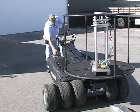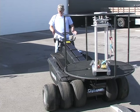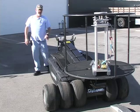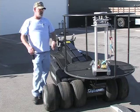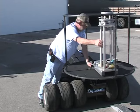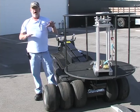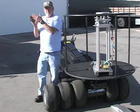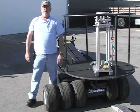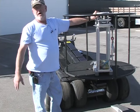Then your pump's off. When you're in a trailer, you want to make sure your drive system is off so that if something were to impact this, it couldn't try to drive itself out of there. Also, on this turret here, if you have the trailer loaded straight on, I want the turret straight forward and locked. That keeps, when you're driving down the road, from the momentum of braking and stuff, from taking the brake out on the turret. So it's always a good idea to have it straight forward while you're driving down the road.